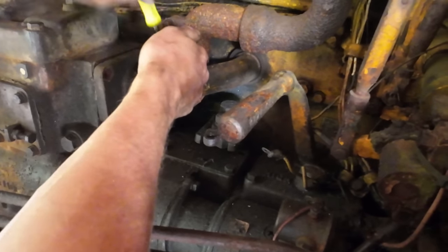The 8 is officially in the shop, guys. A little nerve-wracking, but we came through it. We didn't hurt anything. I put those boards down on the floor, of course, to protect the concrete, and it also disperses the weight from these track pads. When you're in the dirt, the ground pressure is spread out across the entire pad, versus on a hard surface like concrete, you're only putting the weight on that teeny narrow strip on each pad. So it definitely jumps your ground pressure way up.